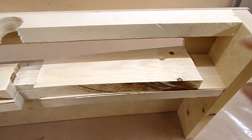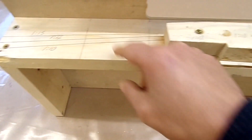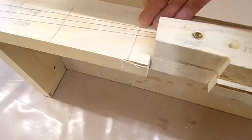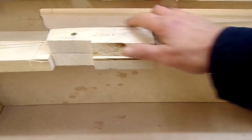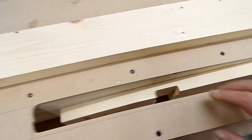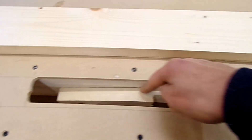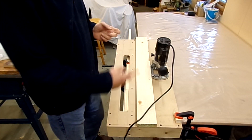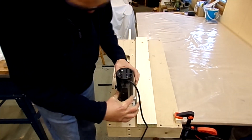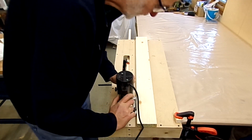Here's a quick look at the jig I use — that's the taper bed, which I can set at different angles. The piece of wood lies on here, it's clamped down. It's basically a box designed so it tilts — that's pretty much level — and then we've just got a guard here to run the router along. The router bit basically just goes along this edge. I'll start this end and work that way, doing it in more than one cut if necessary, so I don't take off too much material. I'll set a height to start off with and do a couple of passes.